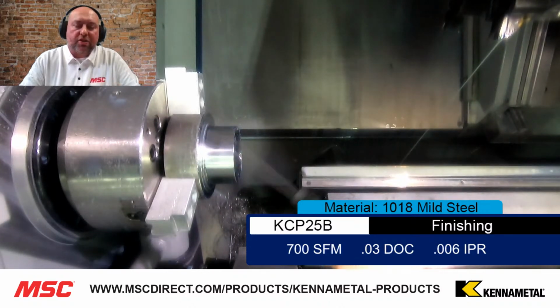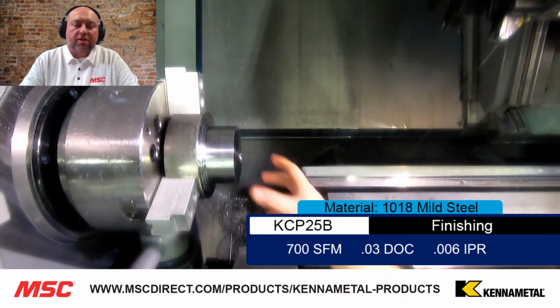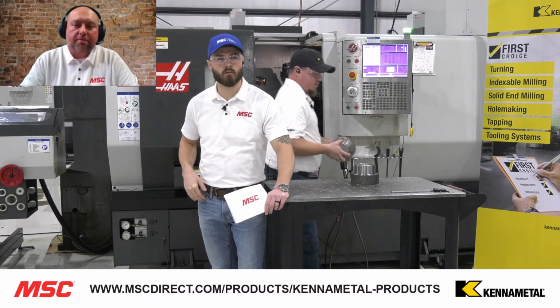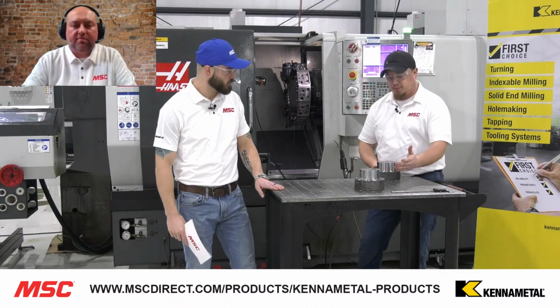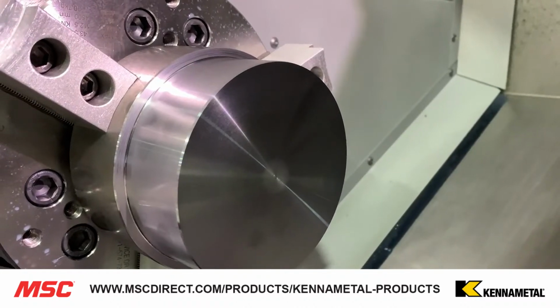You're going to be producing a finish in your old school and your new school method that's going to be generally the same because of the finish that we're going to be applying at 6 thou per rev. Yeah, like we said, you're going to get the same quality part. The part looks great. Finish turned out really nice. So I'm going to go ahead and load this next part in here.